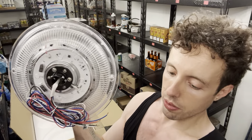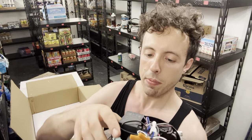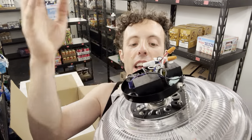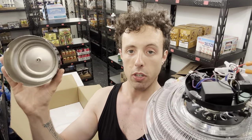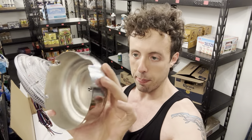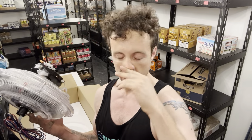Right here is where you can mount the canopy directly for flush mounting without a down rod. One of the cool upgrades on this fan versus our previous fan, the Quorum Prism, is that all the electronics — the pull chains, the capacitors, everything — are married to the fan itself, not to the switch housing. This makes it easy for the customer to just pop the switch housing on and go. With the Quorum Prism, electronics and capacitors were installed in the switch cup with Molex connectors, and customers had to mash all the wires together — a pain, especially for those not used to installing fans regularly.